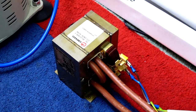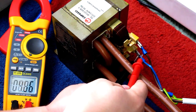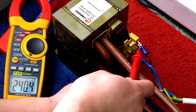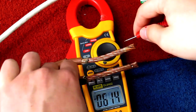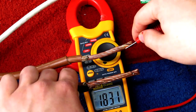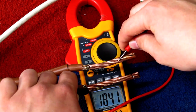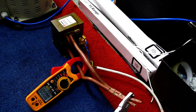So let's get the meter on there and see what we've got. We've got exactly 240 volts going into that transformer. Let's see what the output is — 1.83 volts, so about 1.84 volts going out.